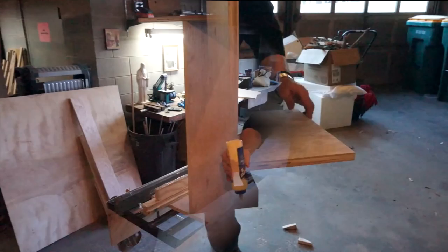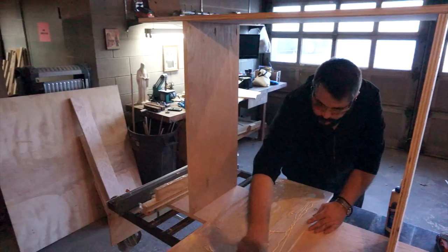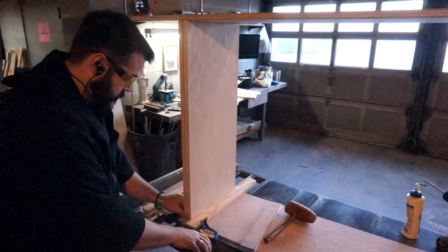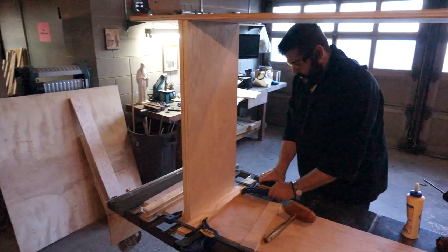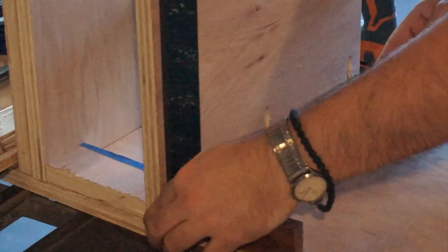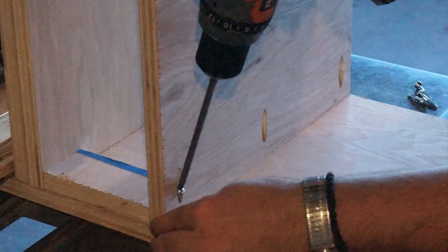I think one of the big problems people have with pocket holes is that it is a type of exposed joinery, and it's not necessarily one that is very pleasing to the eye. So in order to handle this, I've decided to make my shelves an inch and a half thick, and there's a design element I'm working in to accommodate the larger shelves. What I'm doing here is simply gluing one shelf piece to the other in order to hide the pocket holes. One of the differences from a traditional dado joint is that I didn't put the second shelf in during layout, so I'm using a spacer to mark out where the next one is going.